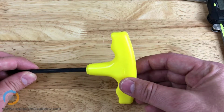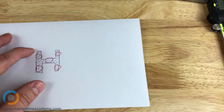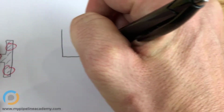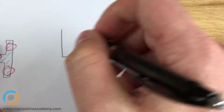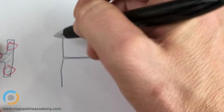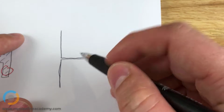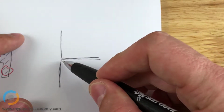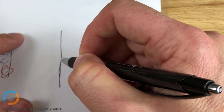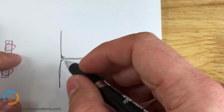If the two halves of the tool are not aligned very well, for example, ideally you would want the edge of your tool, that's maybe the cavity side on top, and then this is maybe the core side on bottom. You'd want these edges to line up perfectly, and you'd want these corners to be perfectly sharp. Well, in reality, nothing is ever perfectly sharp. There's going to be a little bit of rounding there, and that's where your parting line is going to exist.